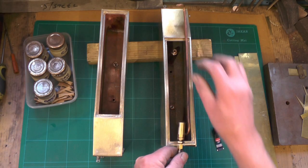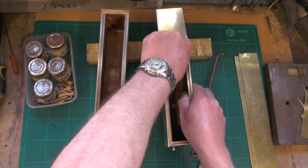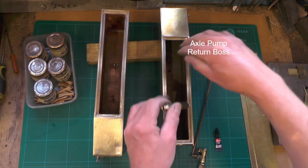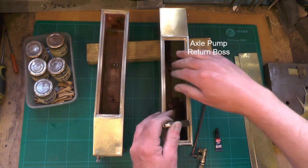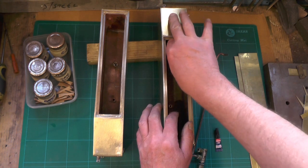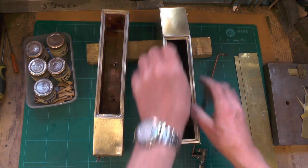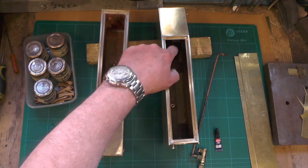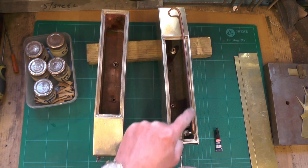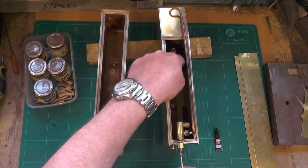I'm going to put my bypass valve in the tank. On the tank here I've made this long adapter to screw onto that boss, because obviously I can't get my hand down there to put a pipe fitting on - I can't physically get my hand in. So I've made that extension piece, and that's going to go into that return boss and screw in and tighten up - I can get a spanner on that now. Then my pipe will come off that, come to the bypass valve inlet, and then return through that pipe and it'll be cut off. So the water then returns into the tank, and I'll be able to see it through my filler cap.